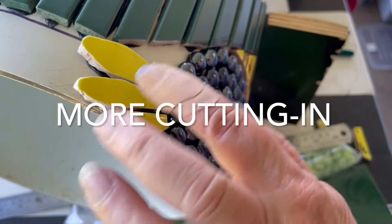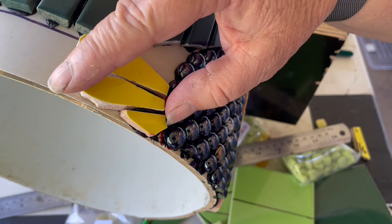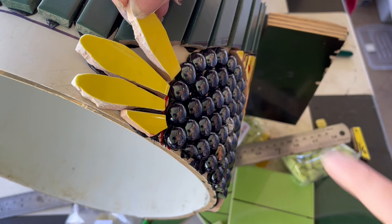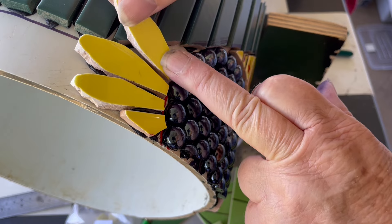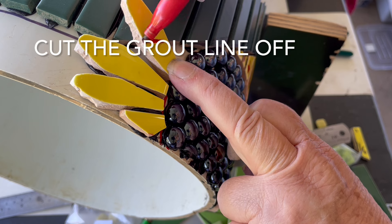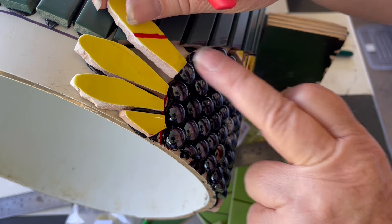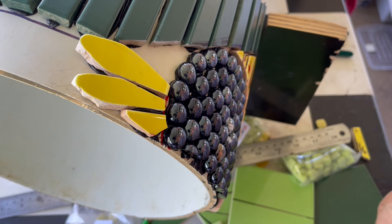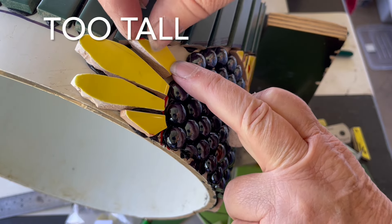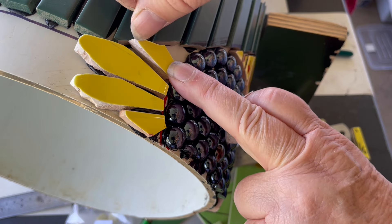This actually needs to come back a little bit. The bits in here need to follow the same principles because we are dealing with keystone shapes — they're petals. I draw the grout line and then I cut the grout line off. Mostly, fingers crossed, it fits — not always. With a bit of luck that'll be the perfect fit. No, I'll have to go and give it a little rub because I didn't quite get that part off.